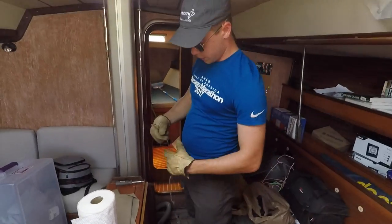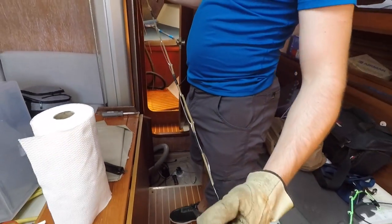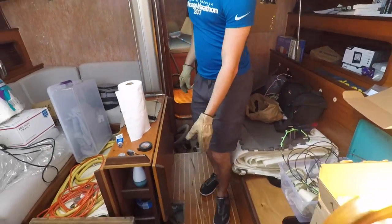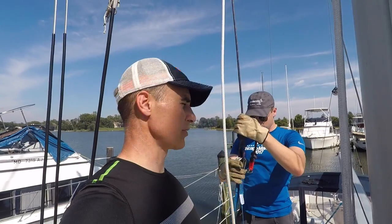We're back for day three of this mast cable challenge. We splice on a paracord — the fishing wire going up the mast is daisy-chained onto 550 cord, taped so it doesn't interfere with anything, and then the 550 cord is daisy-chained onto the actual data cable we're trying to pull up. We make sure it doesn't come loose inside the mast, test the strength — very strong.